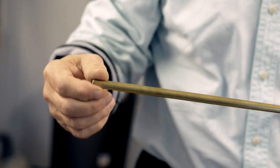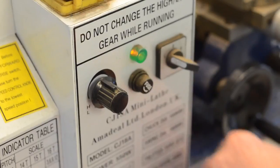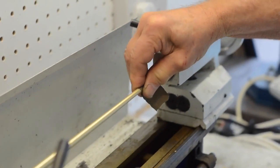My method is entirely different. I use drawn brass tubing without a seam, and I work on the drawn brass tubing to make it into the conical shaped tube. The drawn brass is processed into a conical shape by reducing the small end down and keeping the wide end open, and in the process the walls of the crook at the small end are thicker than at the other end, which is of course thinner.